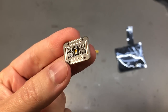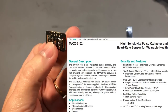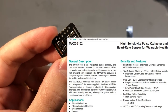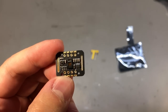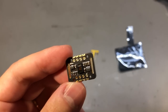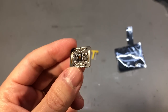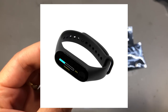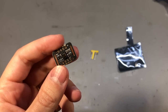The last item in today's video is a sensor module based on the MAX30102 pulse oximeter and heart rate sensor. You can use this to build your own wearables that track vitals. This sensor is a complete system that includes internal LEDs, photodetectors, optical elements, and low-noise electronics with ambient light rejection, all with a digital I2C interface so you just read registers for your data. It would be fairly easy to integrate this into something like a TTGO watch or sports bracelet development kit to track and store your vitals.